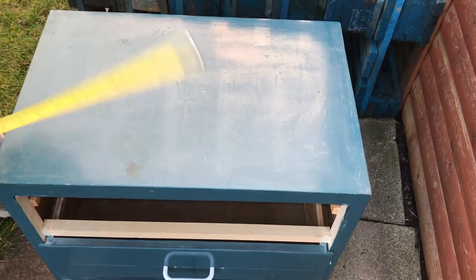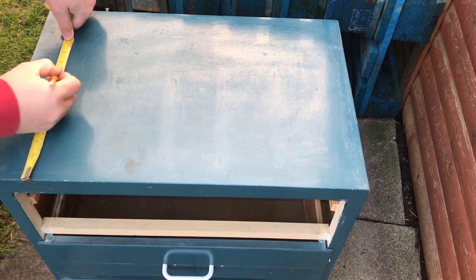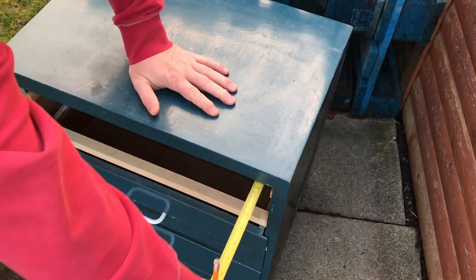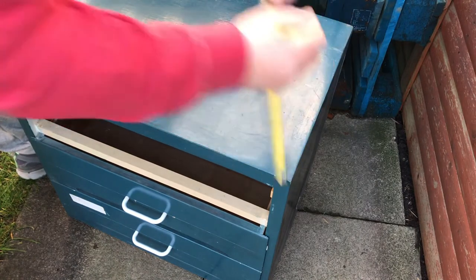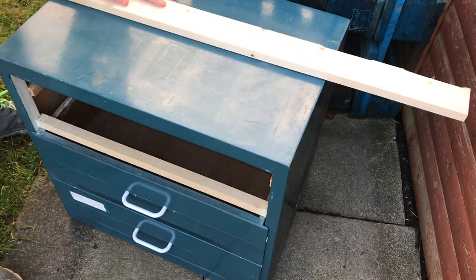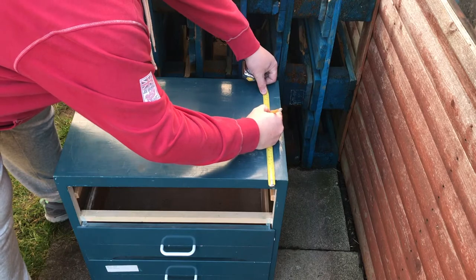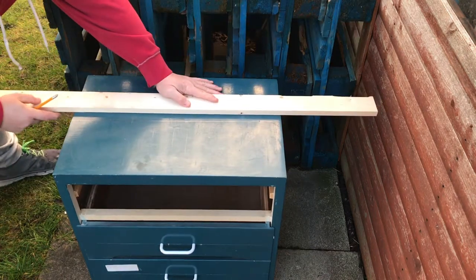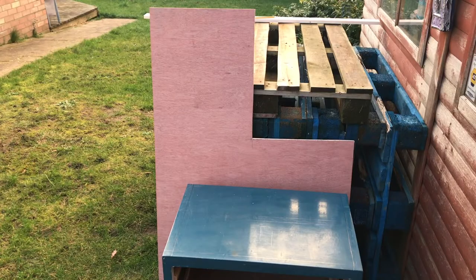Put that mark at 200 mil, check it's square - yep, standard 200 on that one. Put another mark here and we can straight-edge this up. Using an offcut of timber as a straight edge, we can measure one inch here and one inch here, draw a straight line. We know in that area there we've got to put the center fixings. I've got some old hardwood plywood here, 12 mil thick - that's the timber I'm going to use for the top and the bottom.